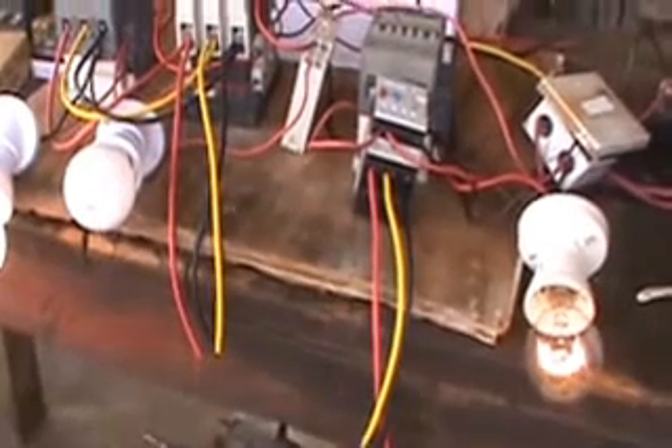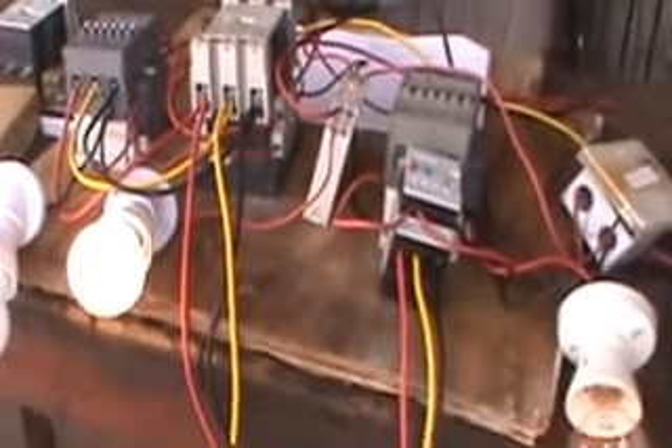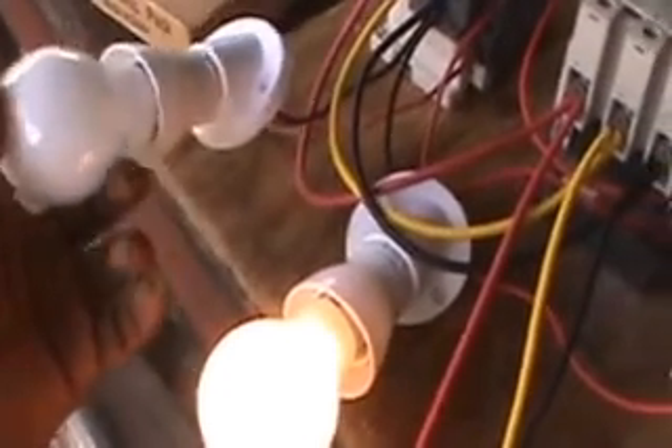All right, that's two lights on. I hope you saw the change — they're not bright enough because they're 220-volt bulbs on a lower voltage, but as you can see the main light is still on, meaning the main contactor is still in and delta is now in. Star was in at first but the timer cut it out to transfer to the delta side of the motor.